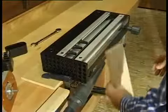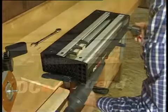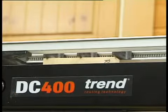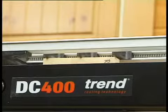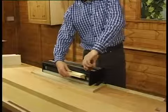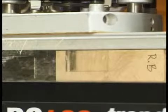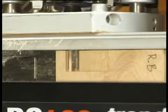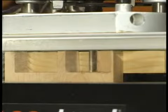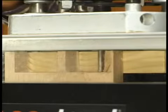Change the cutter to the straight cutter. Clamp against the rear channel with the outside surface of the back facing towards you. Ensure the timber is hard up to the undersides of the guide fingers and against the fence. Insert a breakout piece behind the work. Route each section left to right, taking light passes. As you're about to break through, slow the feed rate.